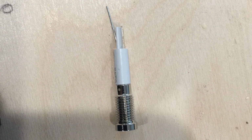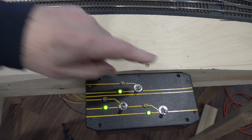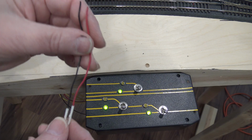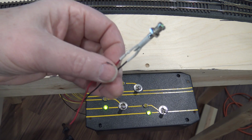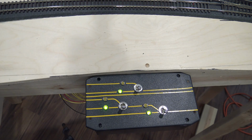So it has those two wires, the long and the short, and by the way, it already has resistors in there and they're already set up for 12 volts. Which is kind of convenient because that's what the tortoise motors run on, or less. So I was trying to solder leads onto them. Well, that was quite fraught with difficulty, and frankly it was kind of a pain.